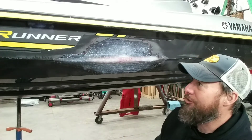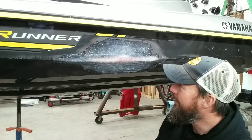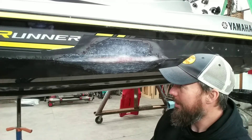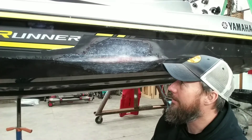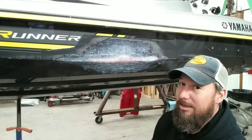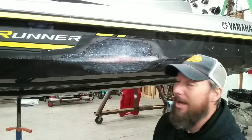We're at six hours right now and it's right at the point where I can hot coat it. It's still pliable — I can push in my fingernail — but I can't smooth it out anymore. So I have two options: hot coat it and smooth it out and just sand it once, or let it dry, sand it, put another coat on, and then sand again.